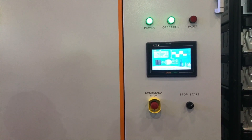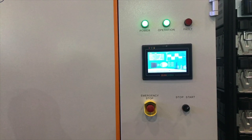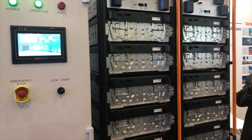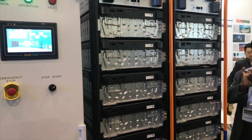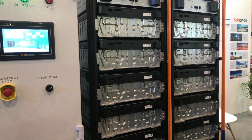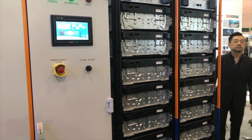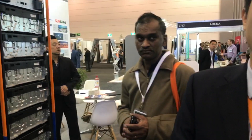This will be suitable for industrial applications. What sort of battery bank could you connect to this? Each rack is 76kWh — you can connect up to 20 racks to this unit, so we're talking a serious amount of storage. If you want to go off-grid with this unit, it's awesome. It can also be a voltage source for the system, so you can use it as a grid.